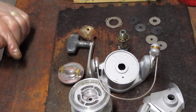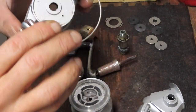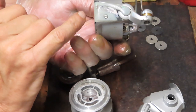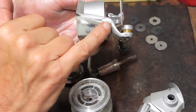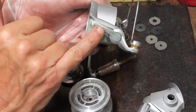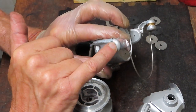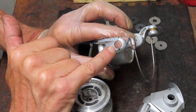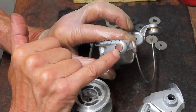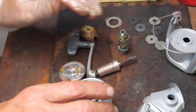So I ran the ultrasonic cleaner, and plus and minus results. From the plastic parts that were painted, they came out very clean. From the plastic parts that had the heavy greening on them, there's just maybe a little bit of greening left over here, but you can see it took it right down to the white plastic. The metal parts came down to discoloration, and that's kind of what I was warning about, that you would see that. It took whatever that mild silver coating was off of that, but it actually cleaned up the bale nicely. Go figure, it's probably steel.